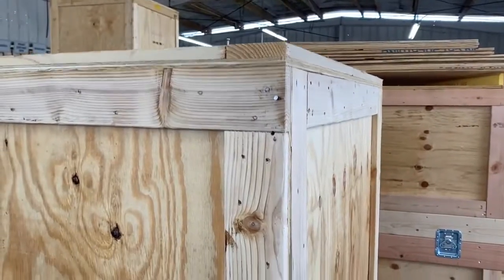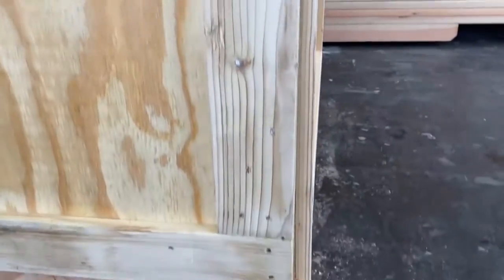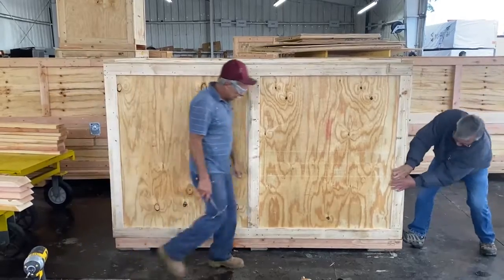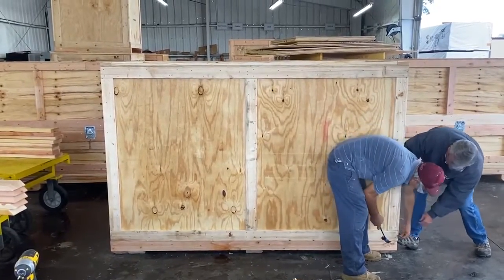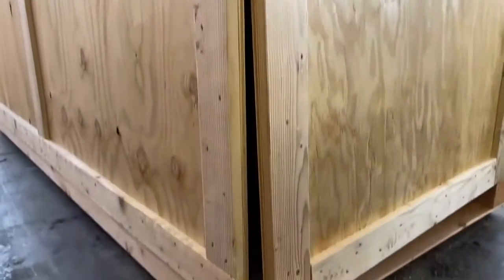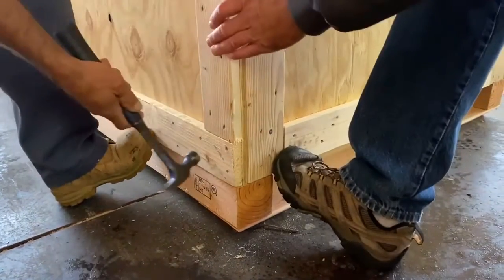Because this is an inserted deck, the small variance in tolerance along the bottom edge of the panels will be absorbed by the 2x dimensional lumber deck material. You can move the panels manually to align with the other panels. Notice the fasteners are not going into the 2x dimensional deck — they are located directly above it and attached to the adjacent panel.